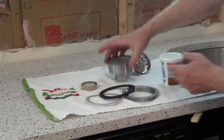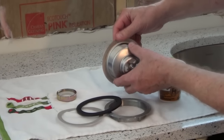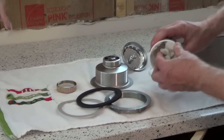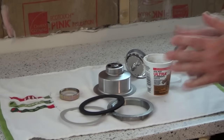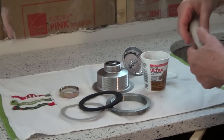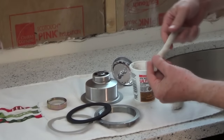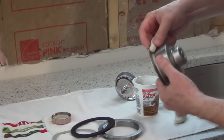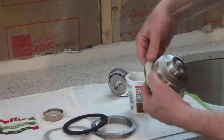You'll want to use that tailpiece washer for the tailpiece coming out of the bottom of the sink basket. We're going to create our own washer, so underneath this flange we're going to put a rope of plumber's putty. I always like to purchase plumber's putty that's called stain-free or non-staining. You can use it for all your projects around the house because it's goof-proof — it works on plastic or porous material, which you can't use standard plumber's putty on. Create a rope about a half inch thick, maybe about the size of your small finger, and push it underneath the flange all the way around.